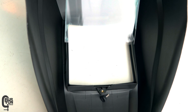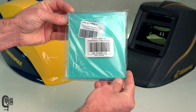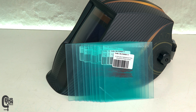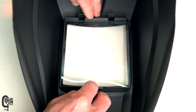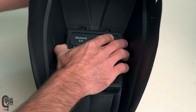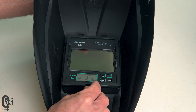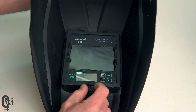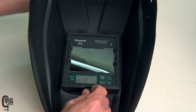Another thing to consider when buying a helmet — and this is probably underrated and not often thought about — is buying replacement front lenses. I've already got my pack of 10 front lenses at 40 Rand each, so they're really not that expensive. Having a nice clean unscratched front lens goes a long way to seeing clearly through the welding helmet. These things are consumable — they get scratched up every time you wipe off dust. As soon as the helmet goes into the dark state with that intense point of light, the light gets diffused and you get a mushy look. Generally it's the front screen that needs to be replaced.